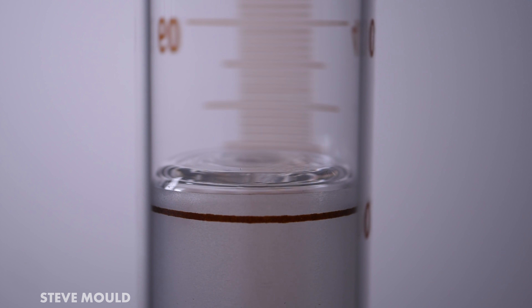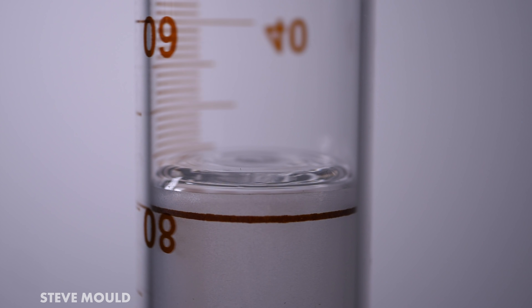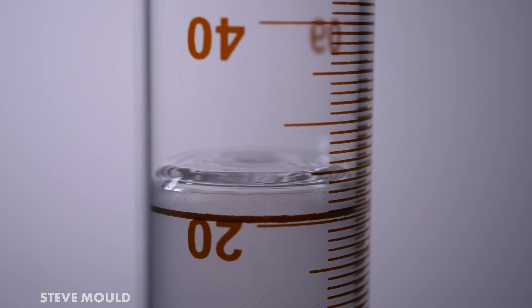Technically they're not perfectly airtight — it's just that the gap is so incredibly small that only a minuscule amount of air could ever escape. Another criteria is that the cross section of both surfaces needs to be almost perfectly circular. If you have those conditions, then when you give the barrel a spin, something amazing happens: it turns into a hydrodynamic bearing. When a hydrodynamic bearing is rotating, there's actually no contact between the two surfaces. We could prove that if these parts were made of metal, by creating a circuit that passes through the syringe and showing that when the barrel is rotating the circuit breaks because the surfaces aren't touching.